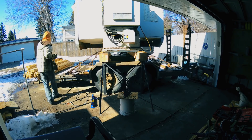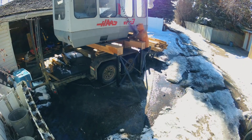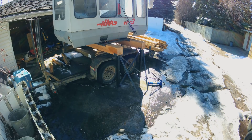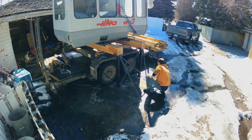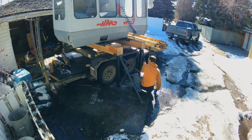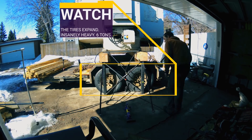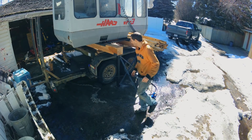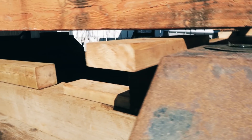The first thing I need to do is get the chains off. These boomers are on there so tight because of the way I tensioned everything yesterday. I had a real tough time getting that safety clasp off. So what I do first is use the jack to press down on the trailer so I can get the last bit of blocking out from underneath the beams. Once I get that last bit of blocking out, I let the jack go and you can see the trailer rise up drastically as the weight is relieved from it. You can really see the tires unloading. I'm off the trailer.